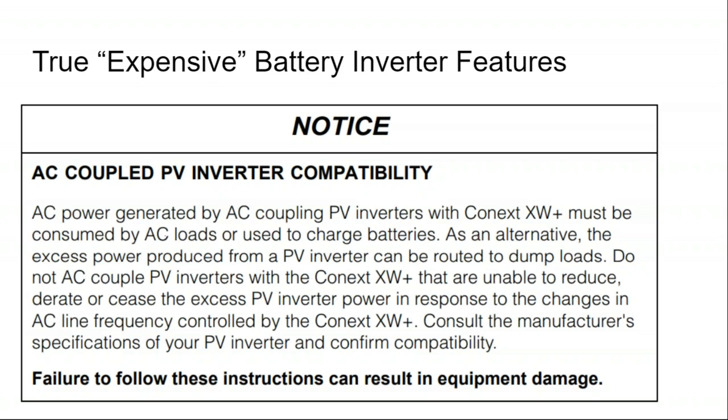Well, that turning off the solar array in the middle of the day because the batteries are charged means you're going to use your batteries when there might otherwise be solar power available. So it's not the most elegant solution. But the more elegant solution is to buy more expensive stuff, and you're just using the very tip top of your battery capacity at times when you pretty much already have an overabundant amount of power. So it's really one of these technical issues. It's not that big of a deal to turn the solar array off for 15 minutes, drain the batteries a little, and then use the solar array to charge them right back up again.